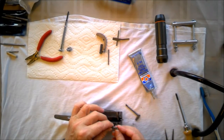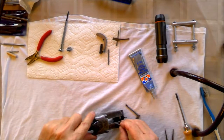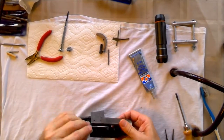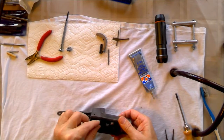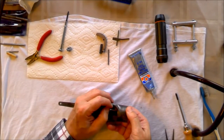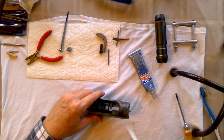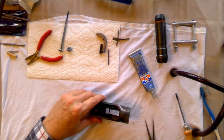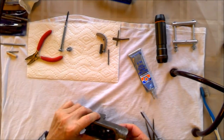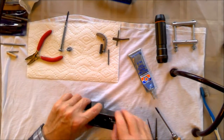All right, so this is going to be pointed. Now that groove's going to be pointed inward. So go ahead and put it in there. I need to press that spring down. And that'll go in like that once it meets that spot. Then, using the space here, you'll flip it down like that. And now you've got your trip spring set there for your barrel.